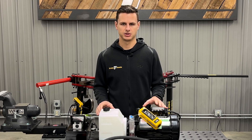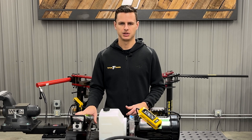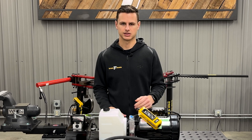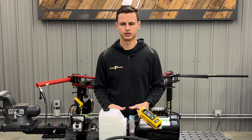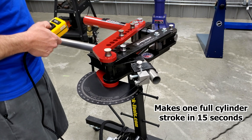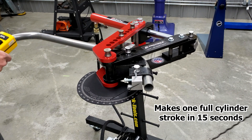It's a lot easier than manually pulling and ratcheting each time you make a bend. As far as some of the differences between the electric and the air: the air provides about 10,000 PSI of force where the electric provides about 4,000. The tube bender only requires about 3,500 PSI, so both of these will cover that.